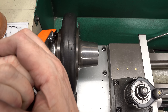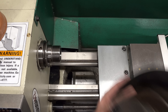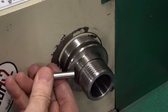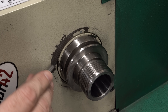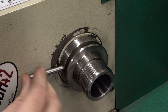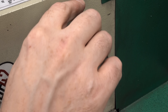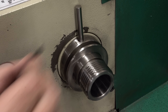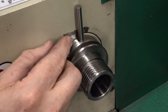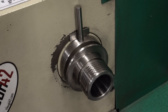There's no good way to hang on to this thing to unscrew it, so I've been playing around with a strap wrench. Jury's still out on how well that works, but if I'm going to make a pin brake, I need some precise measurements. I've got a 312 thou pin and it just exactly fits in these holes, so they're 5/16ths, or 8 millimeter probably.